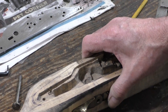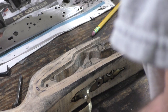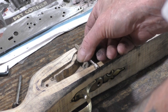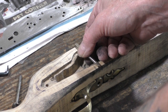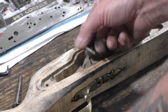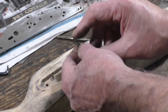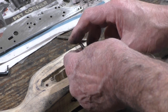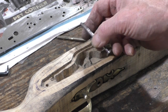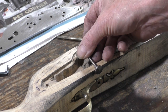I'll go all the way through and have a hole to guide my tap. Hopefully my tap is long enough — it's not going to be very much, but if I can get it started in that tap drill hole, I can take the barrel out and re-tap it through. Then it should line up as a tap hole for this screw. If I've got enough coming through and make a nice rounded-off end, I'm okay. But if I'm not a full thread in that tang, I've got to come in a little more with the trigger guard to get a full thread in the tang.